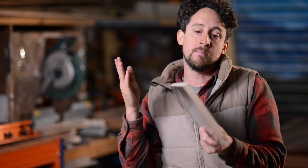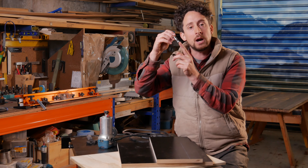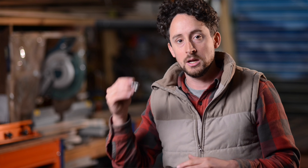The compression bits allow you to get the top cut cutting down into the timber, which gives you really nice clean edges, and the bottom edge cutting up, which means you get a really nice clean edge on both the top edge and the bottom edge of your cut. This is really important for wood that tears out a lot, or veneers, especially on end grain that have a tendency to lift, laminates, and all kinds of things where you need a beautiful crisp line. The other reason it's really nice having an up-cut chunk on the end of this bit is if you're doing trenches - it gives you a really nice clean bottom of that trench. And if your trench is deep enough, you can actually integrate that with the down-cut component to give you beautiful crisp top edges and a really clean bottom.